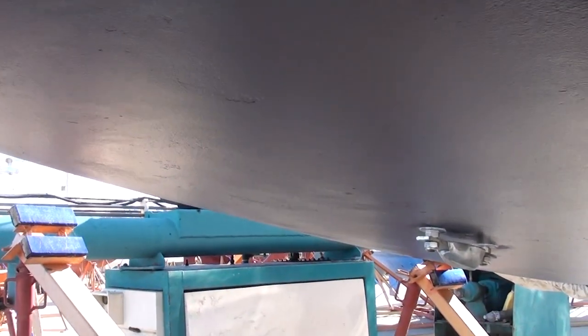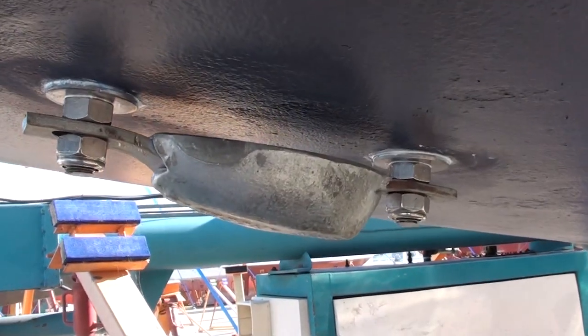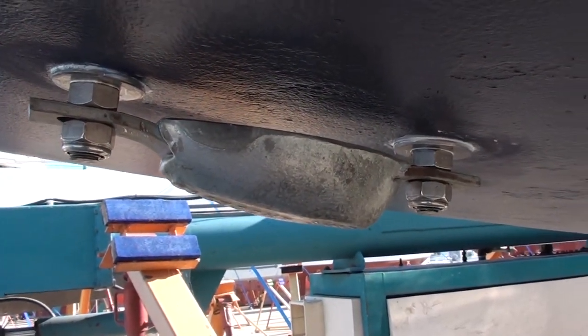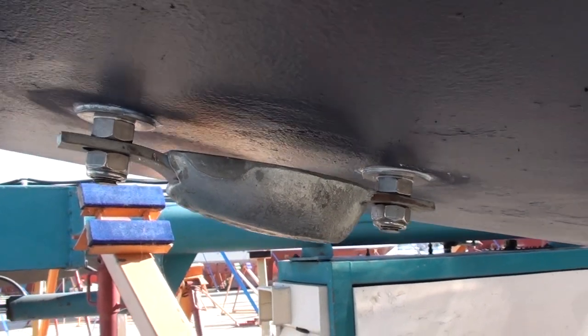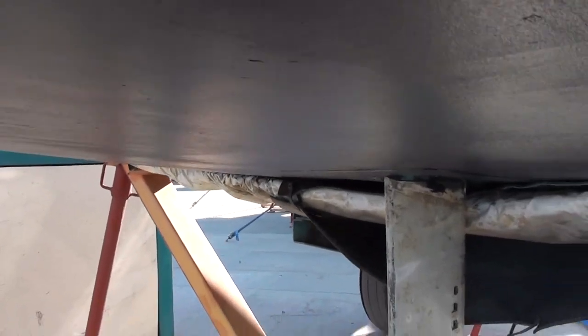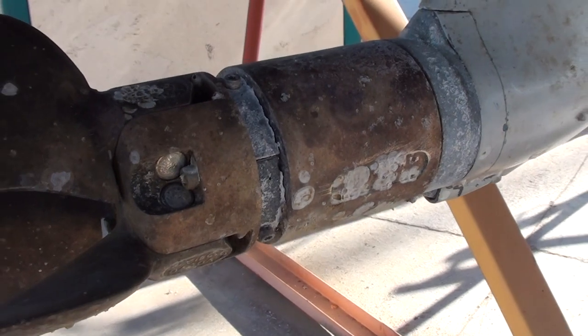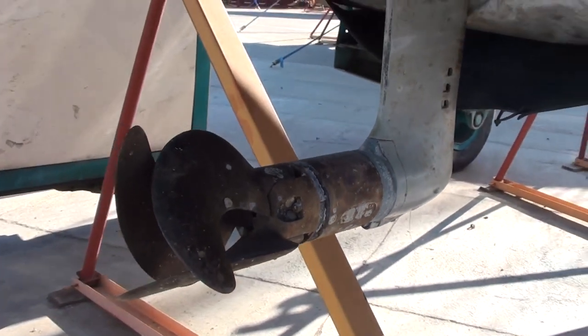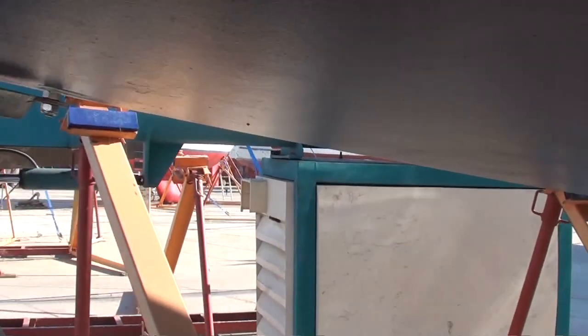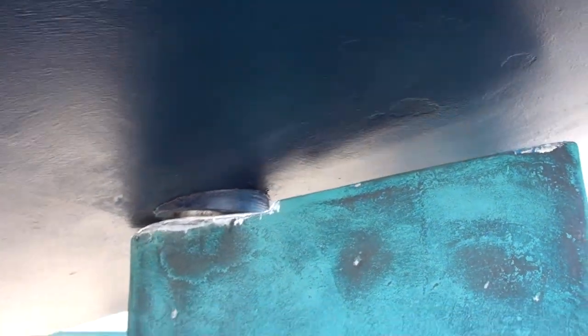And then you can see the whole rudder fitted. We've fitted an additional anode — a rather large, chunky one because this boat is not used for racing, only cruising. Here are the old anodes on the sail drive, and that is all the anodes that were fitted to the whole boat, which personally I don't think is enough, especially with today's electrics and everything on boats when living in marinas. Electrolysis can take place and this rudder stock was not bonded in any way.